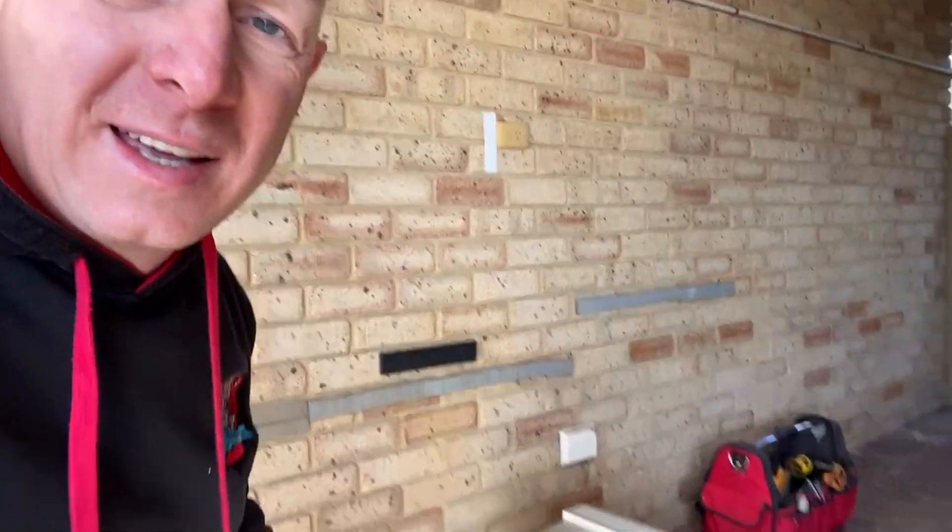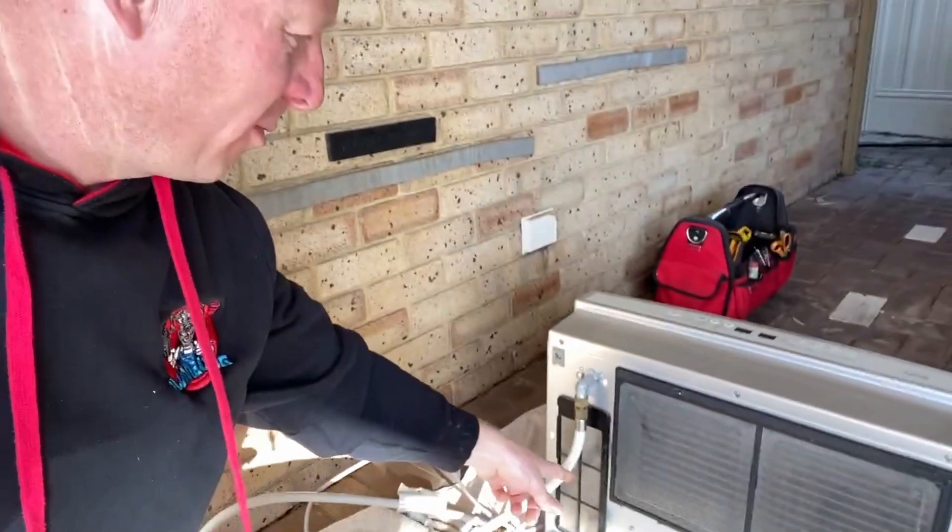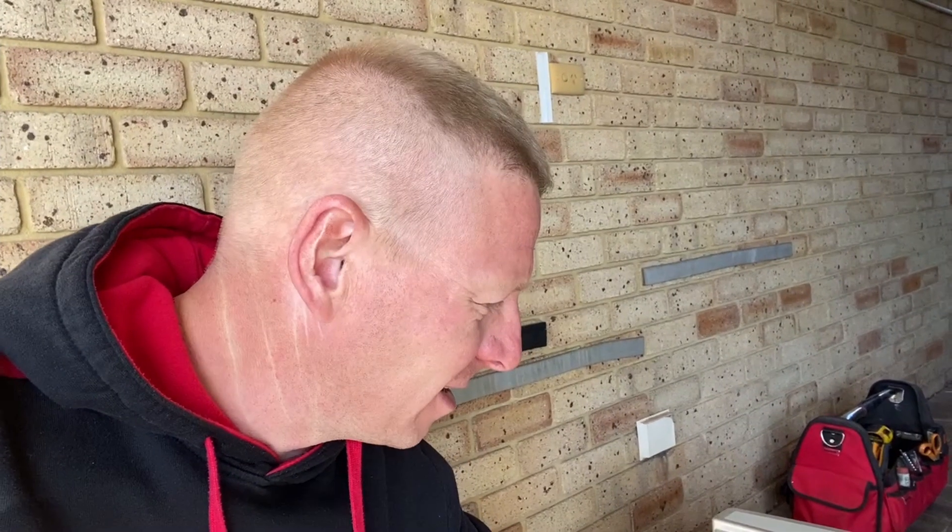I've brought it outside because cleaning these up can be quite a messy job. Basically you can remove these two filters yourself — you don't need to be a licensed plumber or gas fitter to remove those, and you can just blow off the dust and give it a general clean up. Obviously as gas fitters there's a few steps we need to take to do a proper service, which we recommend doing every two years — giving it a real good clean out inside and checking the gas operation and safety switches. But in regards to cleaning the filters, you can definitely do that yourself.